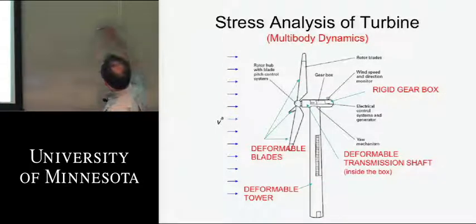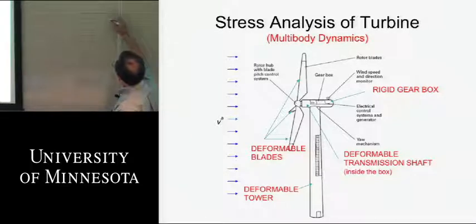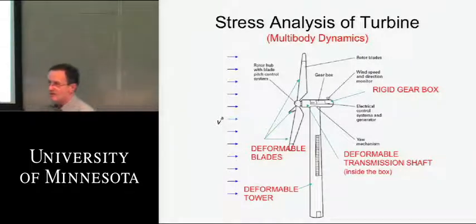So you can imagine that this is a function of, say, elevation and also a function of time. So I have to find those curves at any given time. Rather than looking for the curves, I can select a bunch of points along the tower, and I can choose the number of these points. I can call them U1 of t, U2 of t, and so on, UK of t, and finally UN of t. If I am able in some way to find these isolated values at any given time t, then I can plot them, and just knowing these points gives me a good idea of how the whole structure deforms.